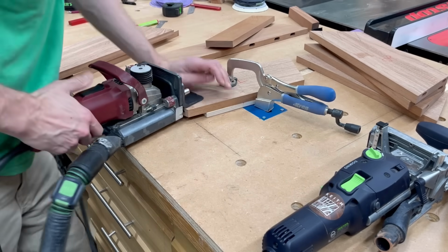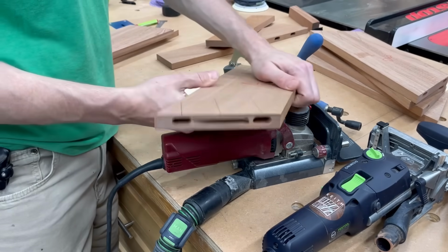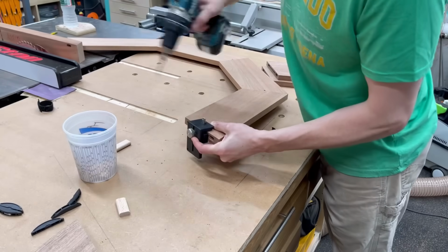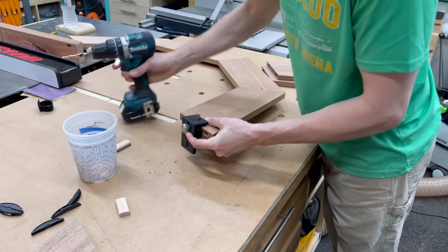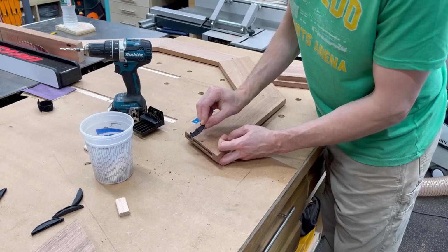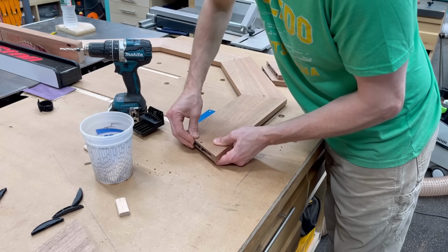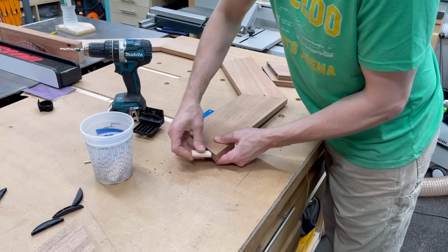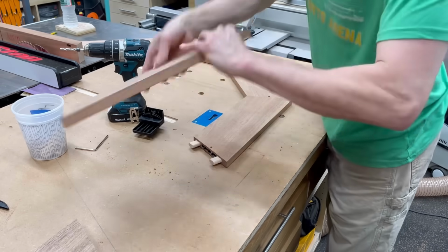So Keith sent some dominoes in on each side of our pieces, and then he used this fancy Lamello plate joiner thingamabob. I'd never seen one of these before, but it's kind of like a biscuit joiner on steroids. You mortise out a slot for a fancy plastic clip, you drill a hole in the bottom of the piece that you can get an Allen key into, then you slide in a clip on one side, add your dominoes that are going to hook the whole joint together, and you slide in a clip on the other side.